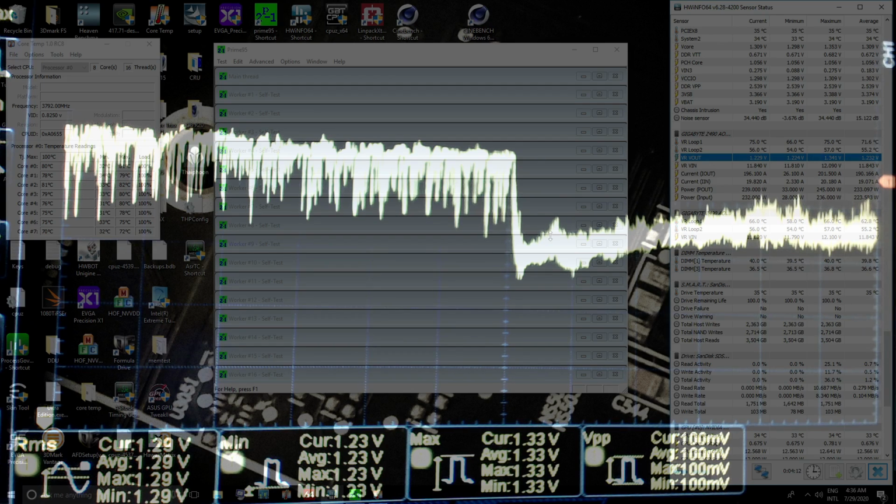If the CPU decides to brake check the car behind it, there's sort of two ways we can make sure that the car behind, the VRM car, doesn't crash into the CPU car. One is we could make a better car, where it's better at braking, but that's very expensive and very difficult. Or we could just have the VRM drive way behind the CPU car. So when the CPU car decides to slam on the brakes, we've got plenty of time to respond. And that's essentially what the extra Vdroop is doing.